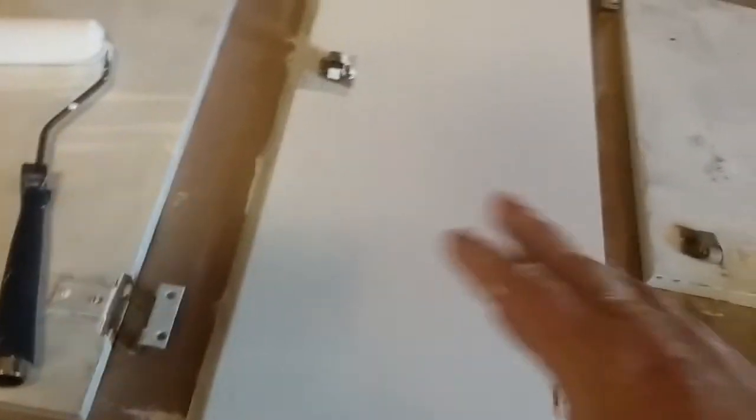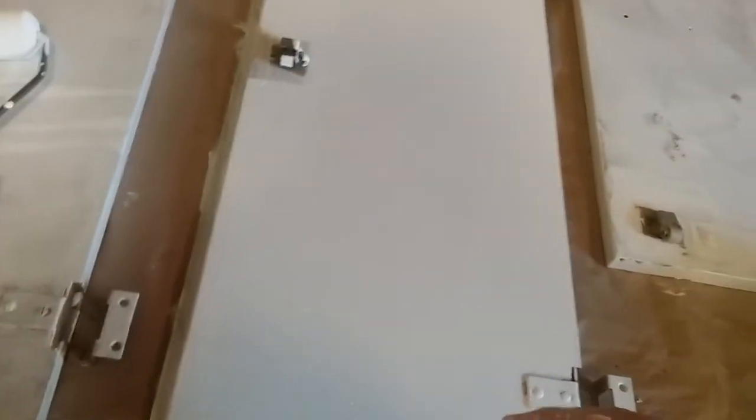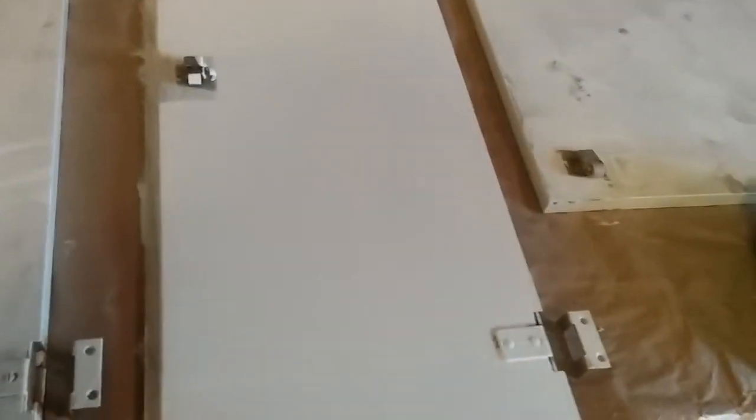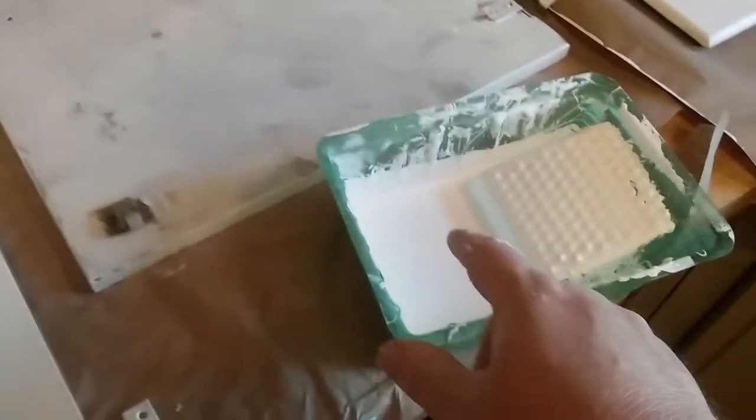I know I got off topic, but I don't know if you can see how nice this is all leveling out. Probably the backs I could get by with one coat because it does level so well, but not going to try it today. We're getting kind of long on this video, so appreciate it. This is how you want to paint your cabinets — front and back of these old saw cabinets. If this was stained or something, we'd be going a different route and I'll show you one of those one of these days when I get to a home that has stained cabinets. But if you want to paint, I believe in scuffing, sanding it up a little bit, primer — and I'm using Zinsser 1-2-3 primer on this, water-based. I like the water-based if I don't have heavy stains to cover up. So anyway, we'll catch you later.